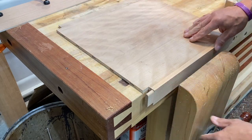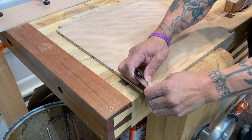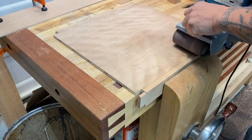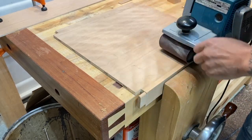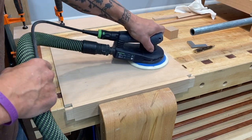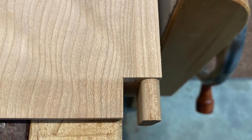This situation is similar but different — this wood is flush with the finished veneer rather than the veneer going over the solid wood, but it's the same process. I'll get most of that glue off with a scraper just so it doesn't gum up my belt sander belt. The flushness of the solid wood and the veneer were really close, so I just started with a 180-grit belt, sanding until most of the pencil lines are gone — leaving a few so I know I haven't sanded too much. Now I can do the final sanding with an orbital DA to get all the pencil marks off and eliminate any scratches from the 180-grit belt, which will be minimal. That is it — I absolutely appreciate you watching this. I hope you got something out of this video. Thanks a ton for watching.